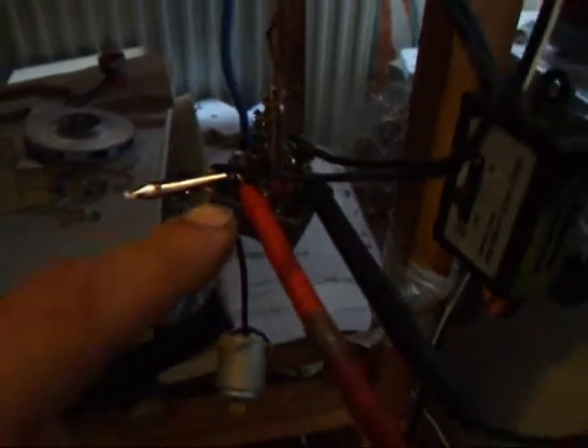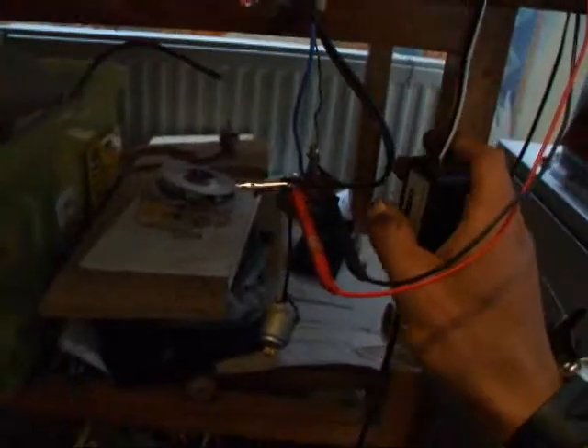Underneath it's set in a 3-phase setup - you've got three wires coming out going into my 3-phase bridge rectifier. Up here I've got two little diodes I've just dug out of the cupboard, wired them in from the single wire coming out, split off the two, and then found which side of the poles it goes on. Dangling down there is a little motor to show usable power.